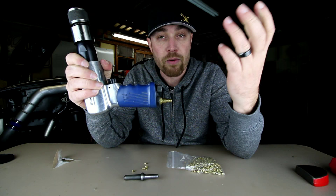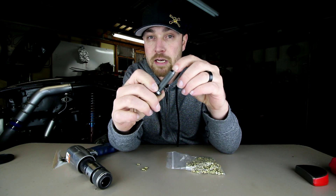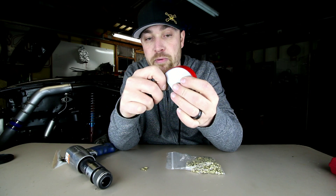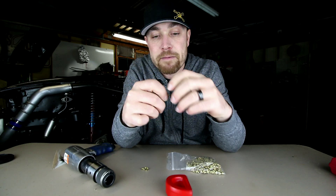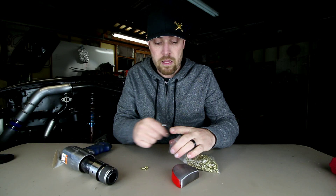Plain and simple - you've got your air rivet gun or chisel gun if you choose, you've got the piece that goes in the end, and you've got your rivet. Your rivet just smashes up on the end of this cup. Usually the head of the rivet is the same diameter and cup shape as the tool itself. It goes through your pieces of aluminum or steel, and then on the back side of it all you need is some kind of buck. This is a solid steel buck here. You press it against there, use the gun, and it kind of jams it all together and smooshes the back - it mushrooms the head on the back. This particular buck will make a flat head on the back side. You retain your dome-shaped rivet on the front side because of the special tool. You do a bunch of those and you've got straight-up aircraft rivets.